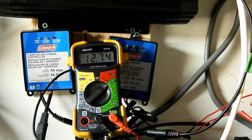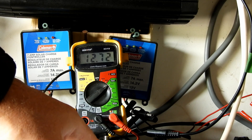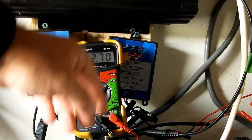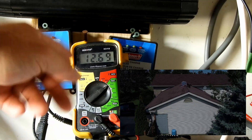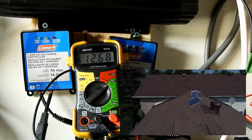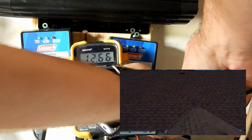What we're looking at here — I have my voltmeter hooked directly up to the battery. None of the panels are hooked up right now. This battery is actually fairly charged up right now. If you have a battery that's really discharged, I'll explain in a little bit about the voltages, because there's going to be a difference in what happens as it's charging. So I'm going to plug in just my 140 watt panel right now, just so you can see what's going to happen. Right now it's at about 12.68, 12.67.